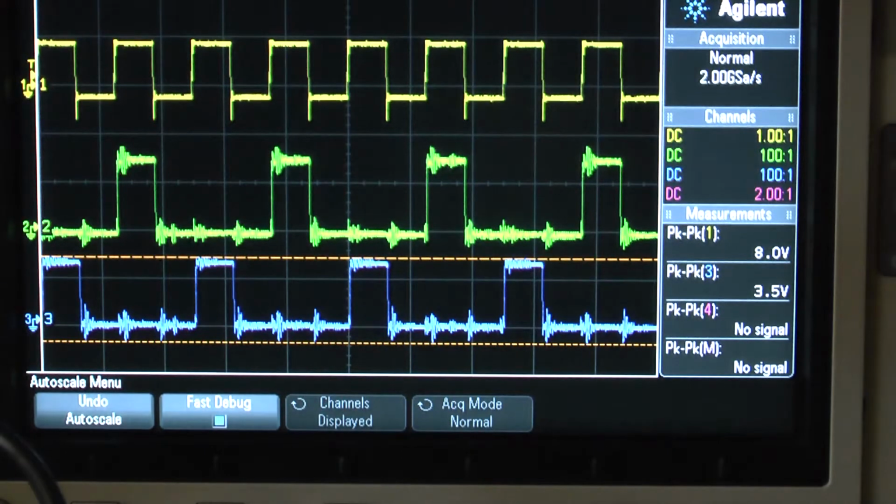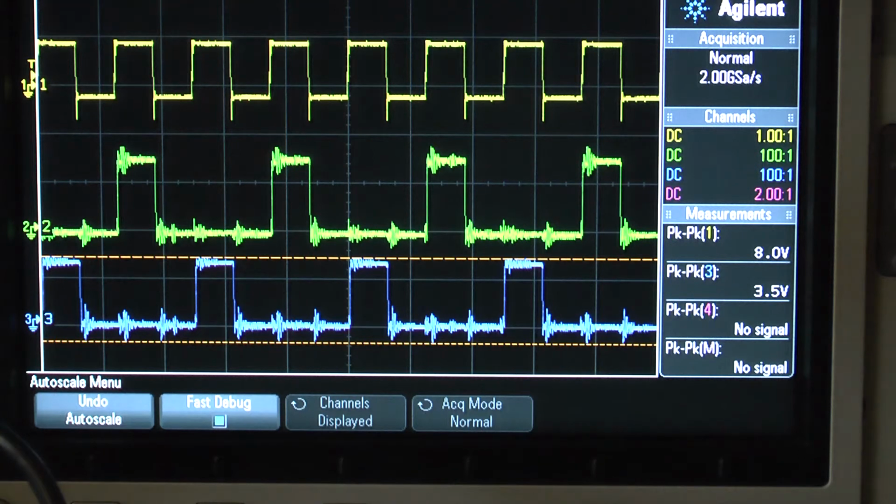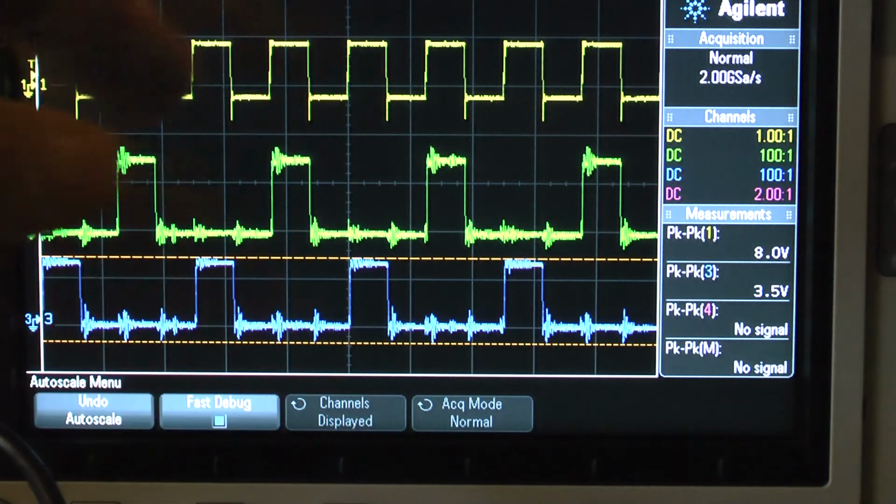So that's how it looks at 400 kHz at the moment. Bear in mind that my probes are not connected properly, so there's probably a lot of noise between the lines. They're not grounded at the moment. No, the grounding has no impact at the moment. So it's definitely coming from the board, I believe. So that needs to be accounted for, so we have a clean signal.